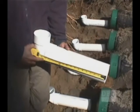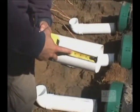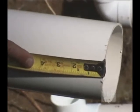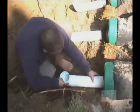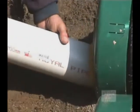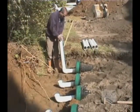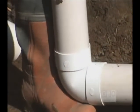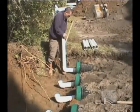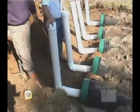In order to be able to get in the EnviroSeptic pipe by 4 inches, take 20 inches minimum for the piezometer base, neither more nor less. It is the way to proceed for the piezometers as well as the vent and water supply. In the bottom holes, slide in a horizontal pipe equipped with a square elbow. Then place a vertical pipe that stands up to the height of your final grade. Once completed, add a cap to the top end.